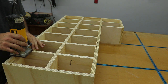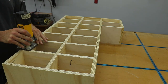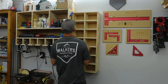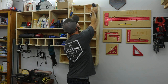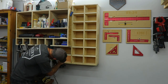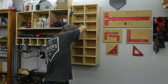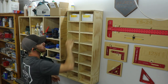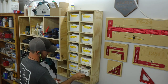After that I went around everything with a 3/32-inch mini round-over bit just to get rid of all the sharp edges. To mount it to the wall I used some 4-inch construction screws and drove those through the half-inch MDF back into the studs — this won't have a ton of weight on it so that works just fine. I spaced them around the corners and put a few in the center as well. All that was left was to load it up — I arranged the boxes by grit and type, which is going to be so much better than moving all my boxes around trying to figure out which one I need.